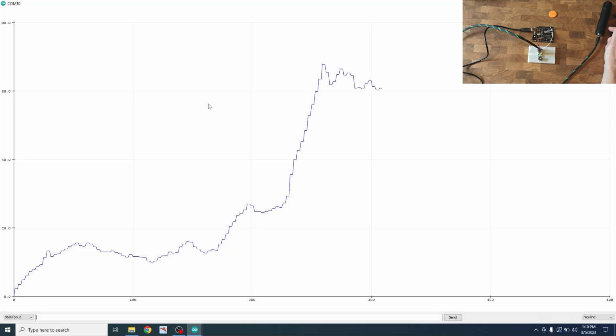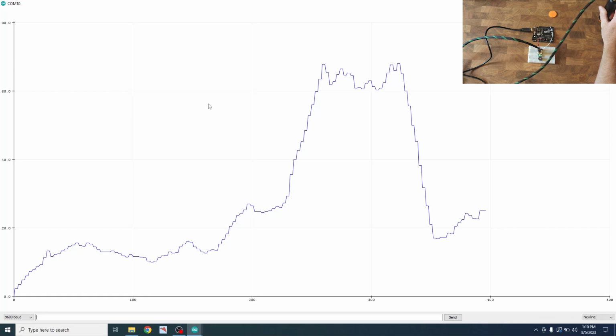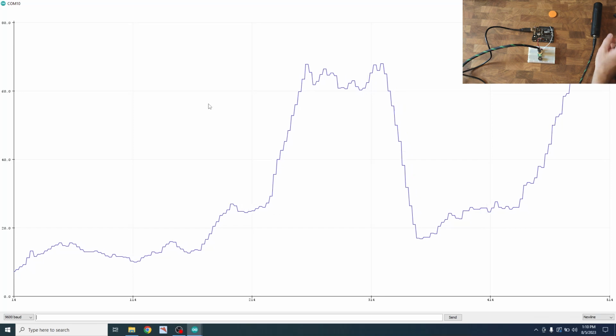It's stabilizing. Real quick side note, the detector's center point of measurement, so the most sensitive part, is actually just right around the circumference, dead in the middle. It's not the cap like that, so I can show you actually. If I go like that, you can see our reading is maybe around 25, 30 maybe, 25. And if I go on the side here, it's already going up. Alright, so to get back on subject, this one, maybe a little bit higher. We're getting around, maybe 70 counts per second right there.